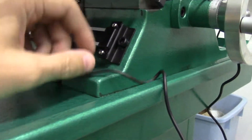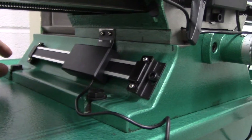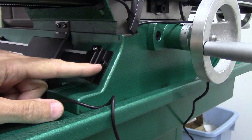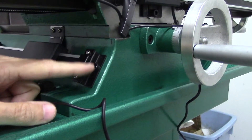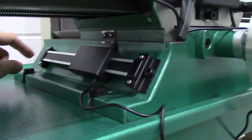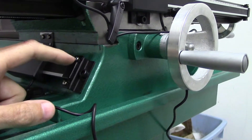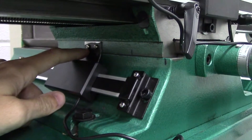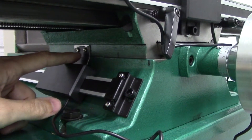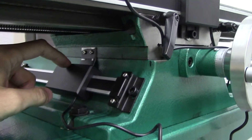For the Y axis, all I did was drill and tap two holes — one here and one on the very end down here. That's pretty easy to do if you have a tap, but you need to make sure you go in far enough if you don't have a bottoming tap. I just had a starter tap, so I had to drill in pretty deep. This one I went all the way through the casting, so just be aware of that. This end didn't go all the way through. There are a couple of screws up here — I got a drill bit slightly smaller than the two screws and they're in there, not very tight but tight enough so this doesn't move.